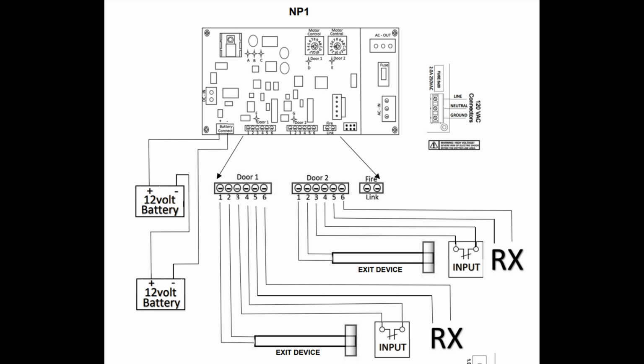The power supply wasn't wired correctly. Oh yeah. It was wired like you would wire a standard push bar, with power being broken through an onboard relay on an access panel. Then I got to looking into it, and you can't make that thing work that way. No, it's got to stay wired. It's got to stay connected all the time. Yeah, the two are talking to each other.